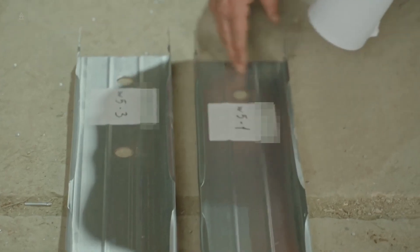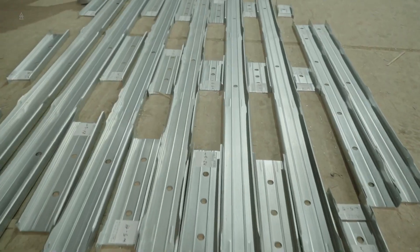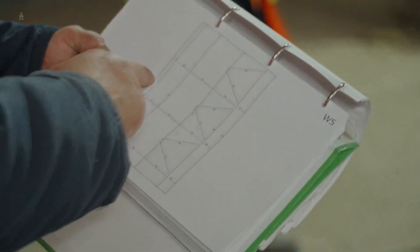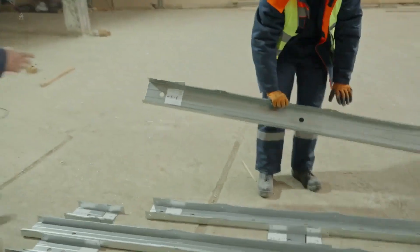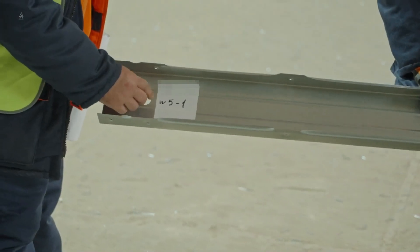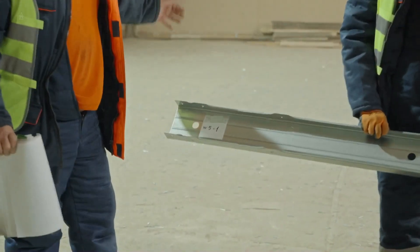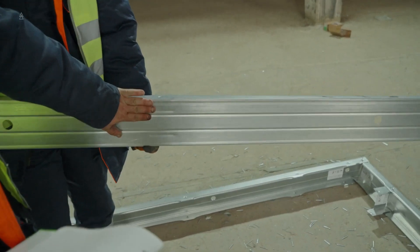Preparing the parts. Lay out all the parts with the markings facing up so they are easy to identify on the drawing. We start the assembly by putting together the outline. This includes the 1st, 2nd, 3rd, and 29th parts. The first part will be at the bottom. To avoid confusion, there is a hole on the panel specifically for this purpose, which should be on the left side. Note that a bold line in the drawings represents the profile shelf — don't mix this up.